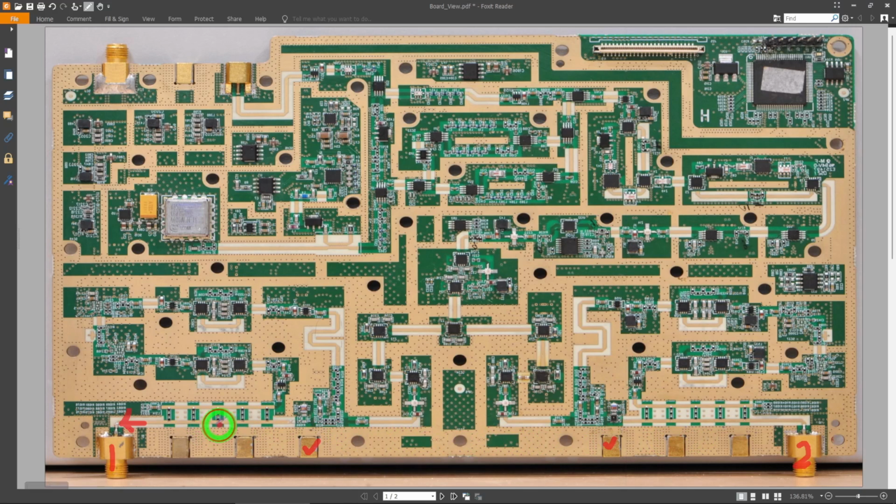So right off the bat, you can see that here we have a resistive coupler. The signal can flow in this direction, but there's also a couple of signals that can flow in this direction. In reality, these signals are all flowing at the same time, but you can use the mathematics to calculate which is what. And there's a lot of other things you can talk about. I've covered it in different videos, so I won't go into the details. Suffice to say that these resistive couplers obviously have a disadvantage because they have lower dynamic range, and the EM-based couplers have directivity, and they're obviously much better, but they're much larger, much more bulky, much more expensive, and this is a common technique to reduce the cost of network analyzers.